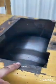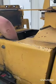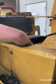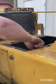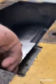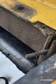Safety pin right here. We've got this BC1000 and RC12, and both of our machines have them. So what machine is this? I see it's a Vermeer. It's a BC1000 XL, yes. With that pin, it slides down into this groove right here. I'll get it in there and you can see it. And that just makes it easier when you're torquing the bolts off and on.